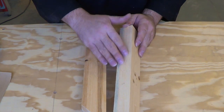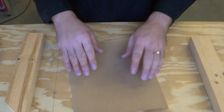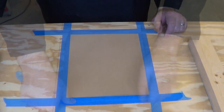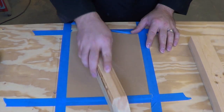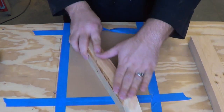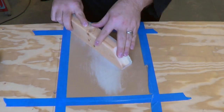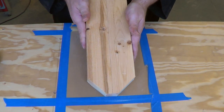But if you're worried about whether or not your bottom is flat, there's a quick trick you can use. Simply take a piece of sandpaper, tape it down to your workbench, and then take one of your jaws and place it on the sandpaper and rub back and forth. You want to put even pressure so that you're not building one side up greater than the other. Do the same with the other jaw and keep doing that until you don't see any significant gaps between the two jaws.